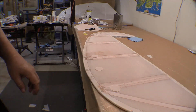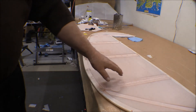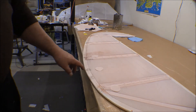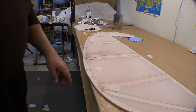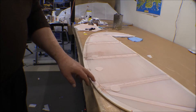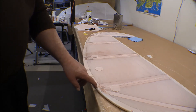I've got the finishing tape applied to both sides of the elevator, at least the ones that go in the field — the ones that go over the ribs. I don't have them yet around the outside edge, the trailing edge, or that forward spar. I'll wait to do those till I get finished with a couple other things. The main thing I've got to do now is heat up the soldering iron and punch the holes for the seaplane drains and grommets.